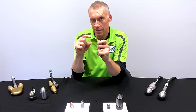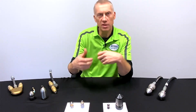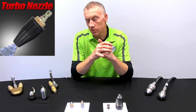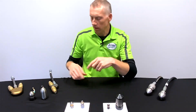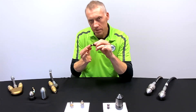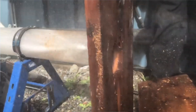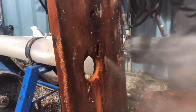This makes for some very intense cutting power. This was learned in the pressure washer industry years ago. Have you ever seen a turbo nozzle on a pressure washer that can cut through a piece of plywood? The first attempts at rotating nozzles for the pressure washer industry just went like this and didn't work well at all. When somebody invented this rotor-against-the-seat technology, it dramatically changed the cutting and penetrating action of those nozzles. As you can see in the video, that rotating jet has tremendous cutting action.